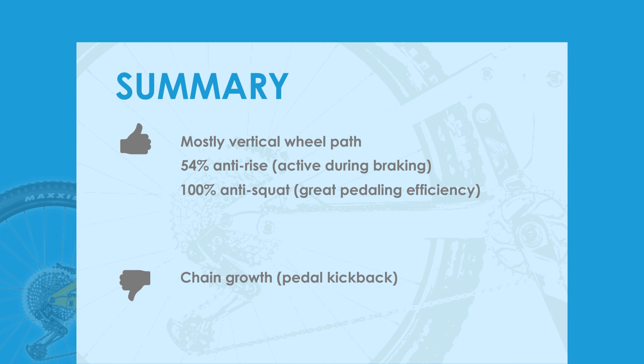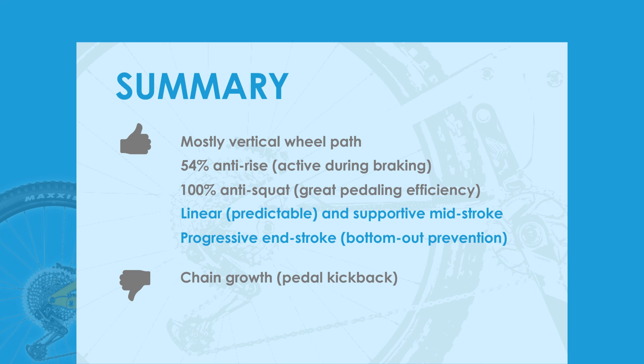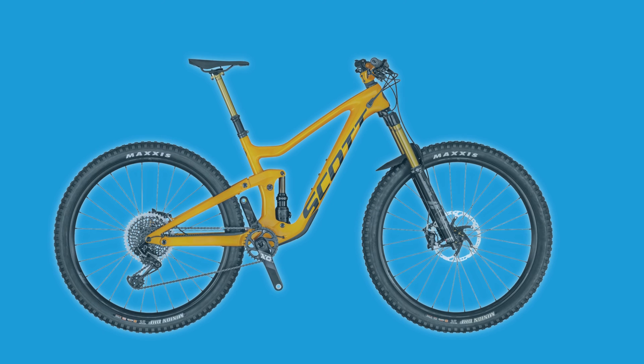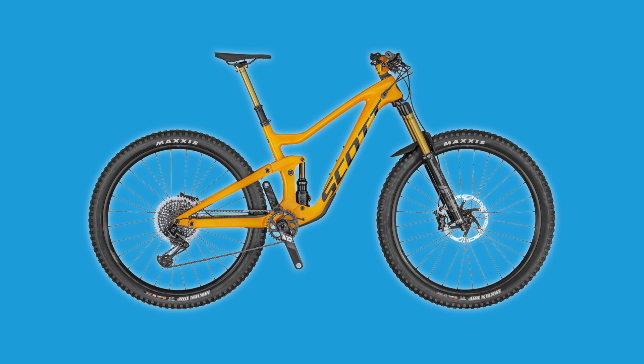So time to take a look at our summary one last time. The Ransom suspension has a linearly increasing force response during its mid-stroke as well as a progressive response at the end of its stroke — both excellent attributes to a well-designed suspension. There's definitely good reason why the four-bar linkage has been utilized by so many companies and bike designs over the years. If you're looking for a new enduro bike, the Ransom definitely has a lot of pros going for it. Hopefully this video has shed some light on suspension design and given you a good idea what to look for when shopping for your next bike. If there's a lot of interest in this video format through likes, comments, and subscribers, I'll likely create other videos for other bike designs as a comparison. Until next time, get out there and enjoy the ride!